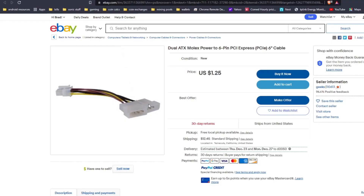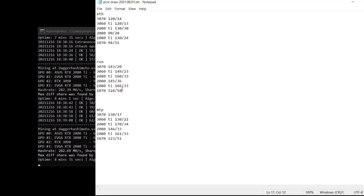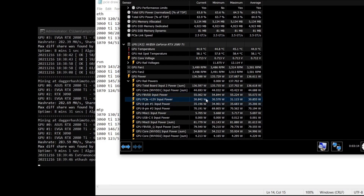If you have to use Molex, I'll go with something like this — a single 6-pin to dual Molex — because then you're staying within the safety limits of what these connections can do. That's how you check it; make sure you're safe, but if you're trying out another algorithm, you'd definitely have to keep an eye on that if you weren't using 6-pin. I always recommend 6-pin just to be safe. So there you go, have fun checking out your cards. Let me know if you find something that's over 50 watts down in the comments. Thanks for watching today, guys — I'll see you on the next one. Later.